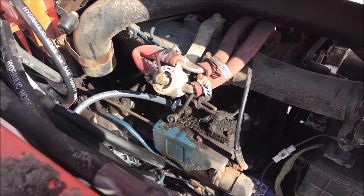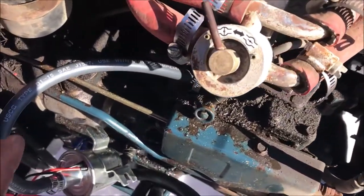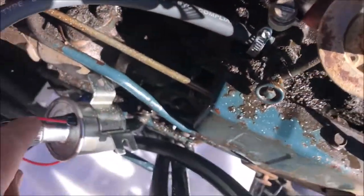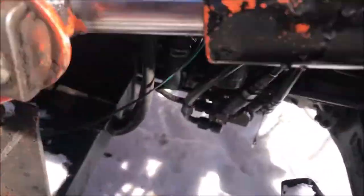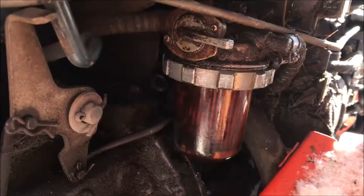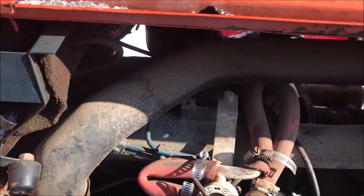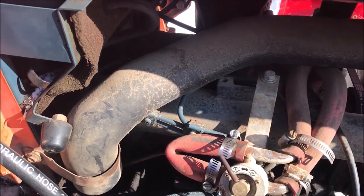Here's the wrap-up: I just spent an hour and a half plowing and everything went well. My final solution was to run this output line that goes to the injectors, with this electric fuel pump that comes in from the fuel tank. So I had two problems when this great adventure started: first, my little lift or transfer pump failed, and secondly, I ended up with frozen fuel lines.